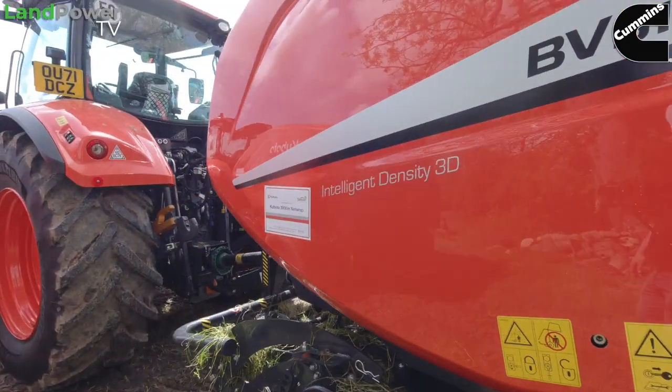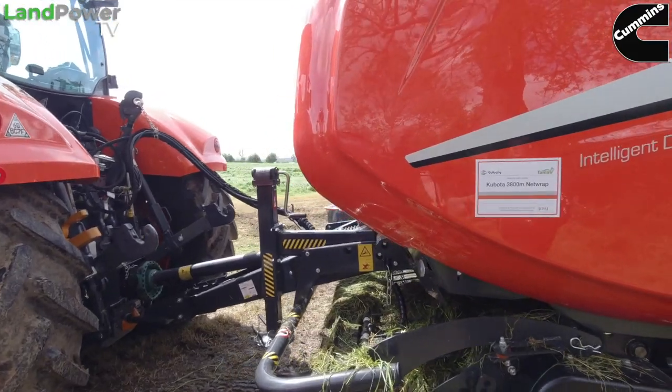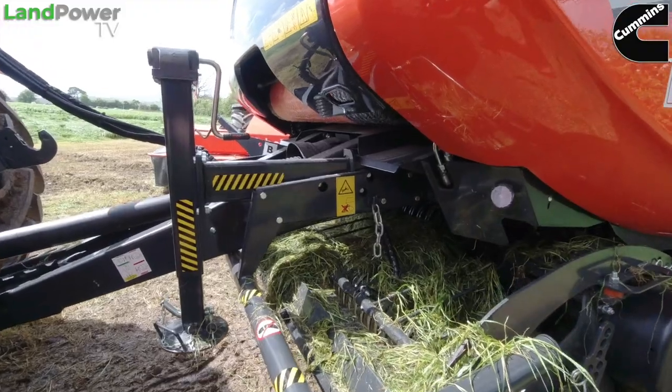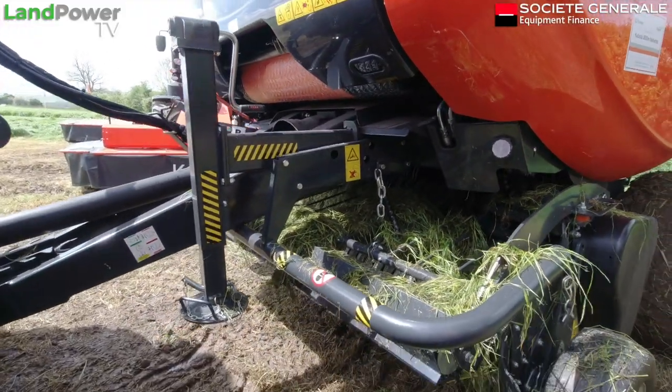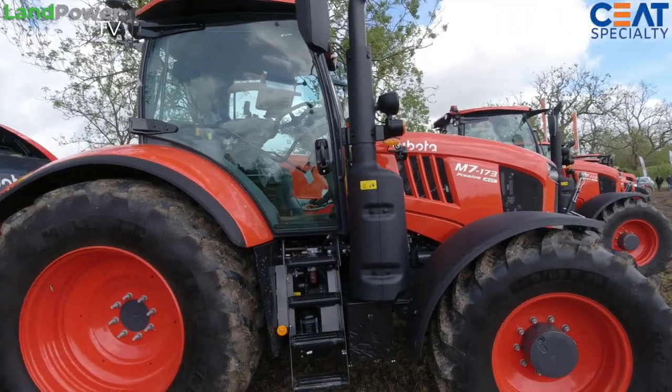No, what you have to do is activate the system. The only thing you do is press the go pedal. So on the KVT tractor specifically, you just press the go pedal, it then goes back to a preset speed. So the operator is controlling the forward speed of the actual baling, but then the baler is controlling it when it slows down, stops and starts.